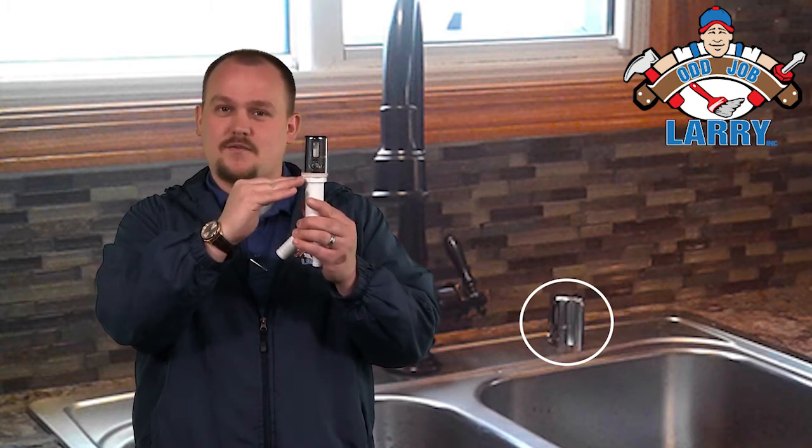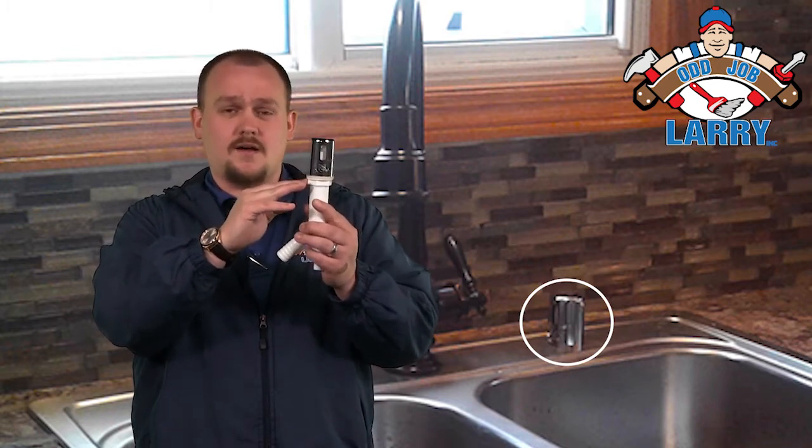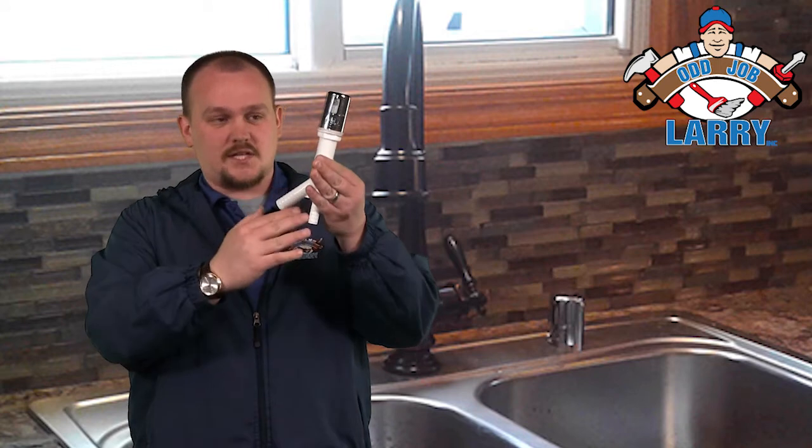You probably see just the top half here above your sink, next to your faucet or the sprayer on your kitchen sink, but there's actually this part below too. It connects your dishwasher drain to your sink drain or to your disposal, and the purpose is to prevent dirty water from getting vacuumed or back-flowed into your dishwasher.